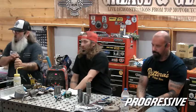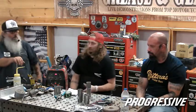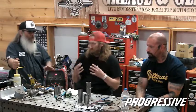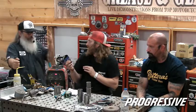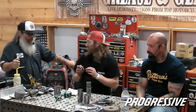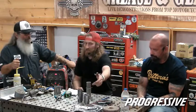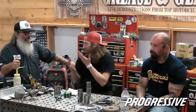Well, I think a lot of times it's good to have stuff fixtured up and held down and properly tacked numerous times, and let it cool. That way, you don't have to worry about it shrinking when you run between tacks, because the backside already has 3 tacks on it, so it's not going to be able to pull as much. It'll still shrink, but it's just better to distribute the heat on stainless as opposed to mild steel, I guess.